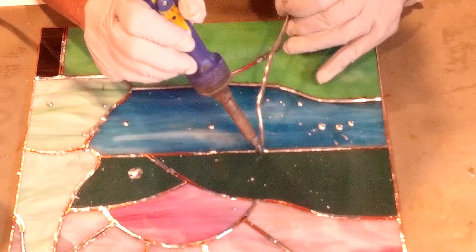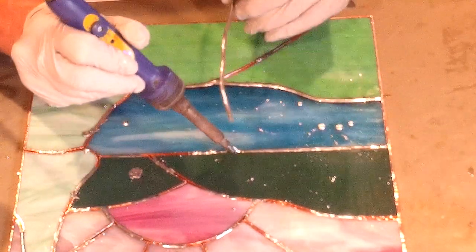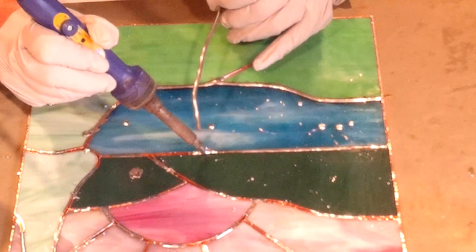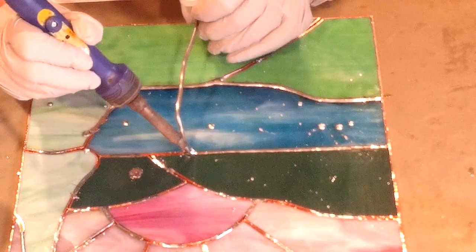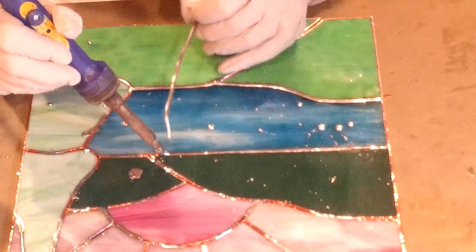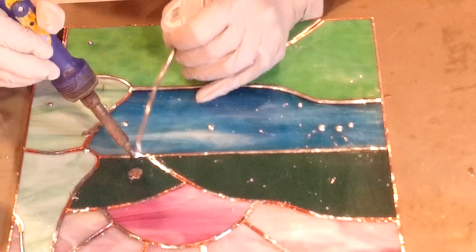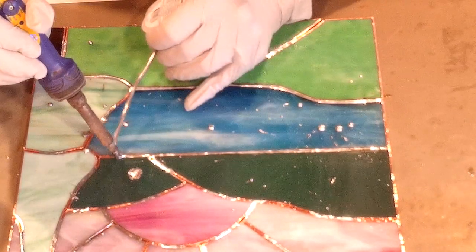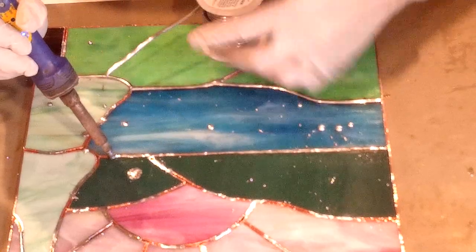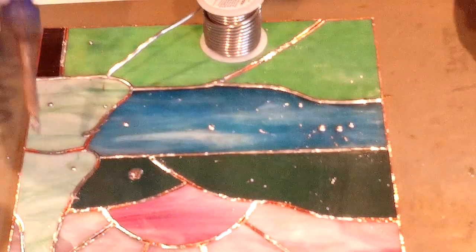Again, I need a little bit more bead, so I'm going to add solder on the side of my iron. And that bead got bigger. That's a better size. Again, if you're having trouble soldering, go an inch, stop, add solder. Go an inch, stop, add solder. Okay, before you start moving along. But once you get better, it's this all-important bead. That's all I'm looking at. Okay?